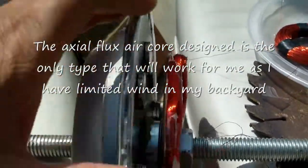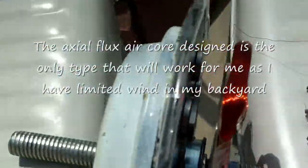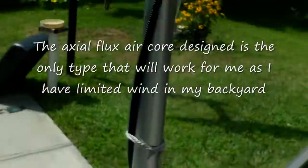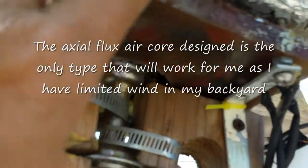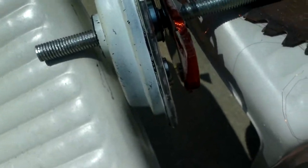This stator and magnet plate here is very sturdy. Let me show you what I had before as a stator. This is the stator for that windmill — 6 coil, 22 gauge wire, but it never gave enough voltage. So this is the new setup.